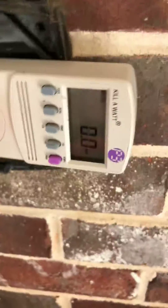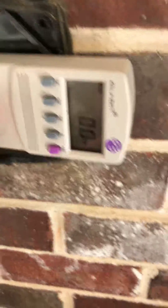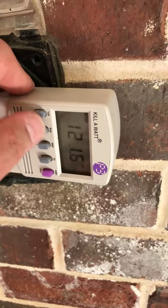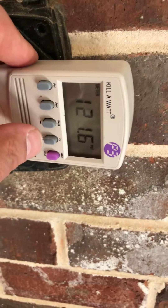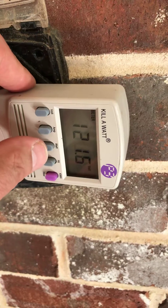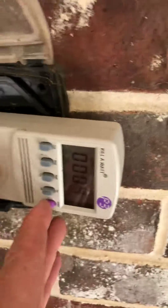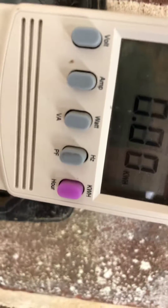These Kill-A-Watt devices are just awesome. They tell you not only how many watts are running at any given second, but also the total watts over time, the amps, and the volts. If you know volts and amps, you know watts — if you know any two of those three things, you can calculate the third. It also tells you how long you've been running it and how many kilowatt-hours you've used. I've only run it for four seconds, so not even a fraction of a kilowatt-hour.